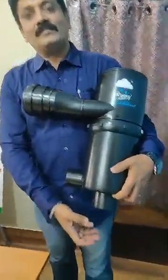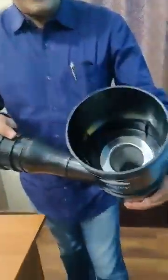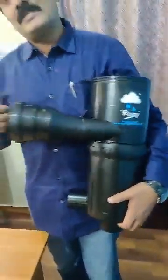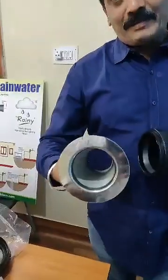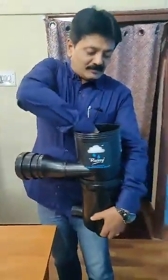These are the only filters which are self-cleaning. Because this filter doesn't come with any ball valve at the bottom, whenever it rains you can see all the dust and debris goes out of this filter automatically and the clean water comes on the other side. This filter has SS304, 250-micron stainless steel strainers which give very clean water.